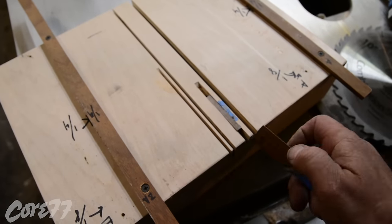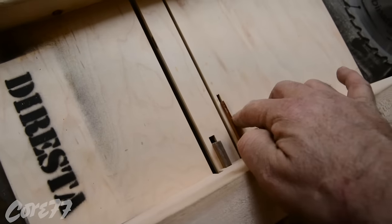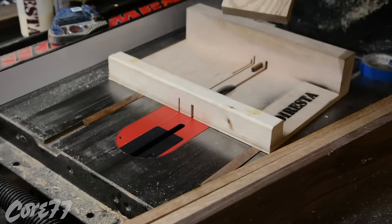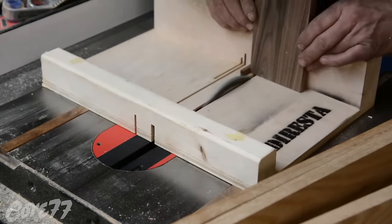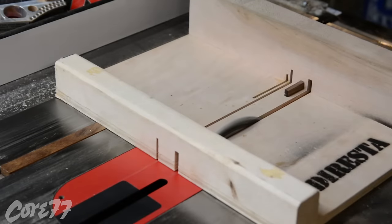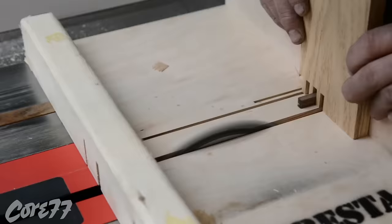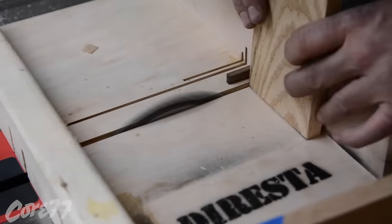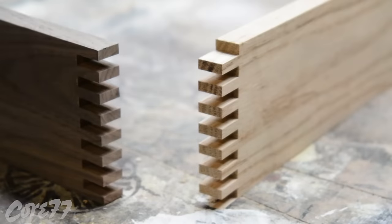In this video I'm going to use both positions. Right now I'm starting with the quarter-inch position. I move the guides into those positions and then use the actual kerf of the thin blade for a second set of boxes. Here I am just cutting and cutting and cutting. The most important thing, since I'm cutting them individually, is that I know where the top of each side is so they all puzzle together facing the right direction. That's why I put blue tape on them — so I know each side is the face-up side. There are lots of great videos on box joint jigs, which is how I learned. Those are all my joints and they fit together perfectly.